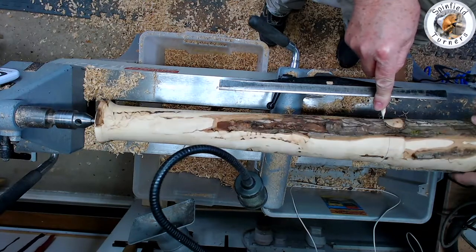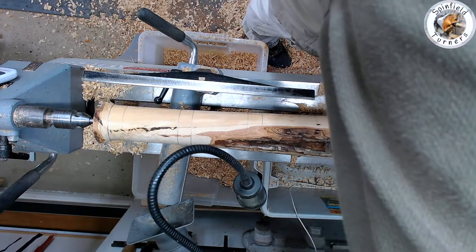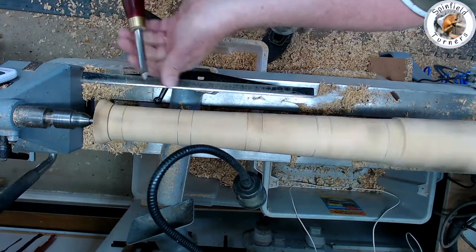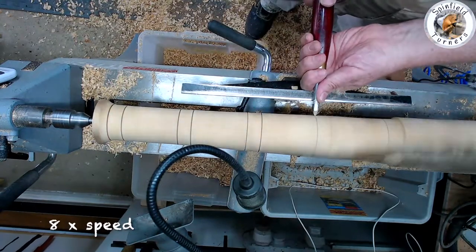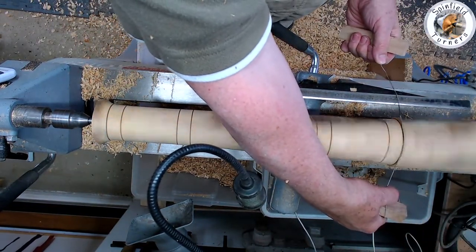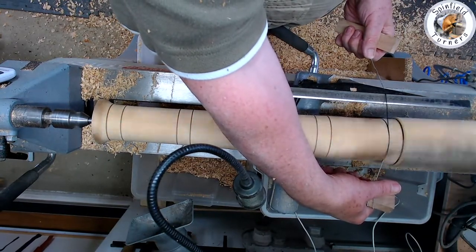I'm going to mark it up so I've got four sections and some bands which I'm going to do a bit of texturing in. I'll cut those bands and demarcate them with my point tool, which is cut into four sides — nice and sharp, produces a nice clean cut — and then I'll use the burn wire. This is a DIY burn wire made from what I think is a bass guitar string, one with spirally coils around it. In a nice deep V-notch like I've just cut, those spirals almost cut into it and create a really good burn, so it makes a nice deep burn mark throughout.